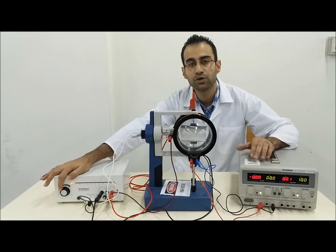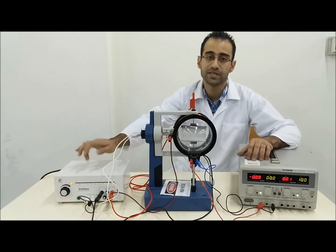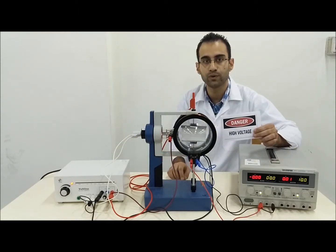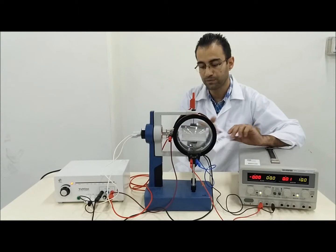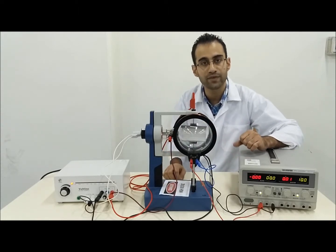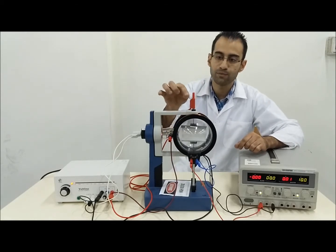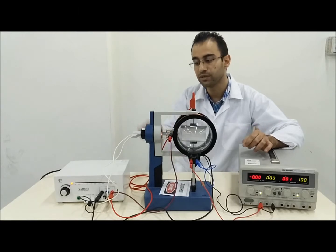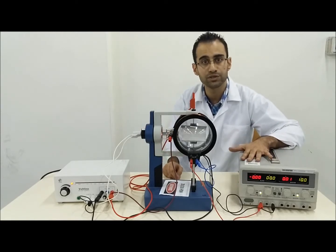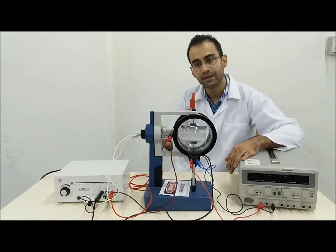Each small segment on the scale equals 250 volts. This experiment deals with high voltage — you will be reaching about 4,500 to sometimes 5,000 volts during certain steps. You should be extremely careful with the leads. Do not touch any of the wires, and always use the protected connection type. If the supplies are on, never change connections or touch any wires. Always switch off both supplies before making any connection changes, then switch them on again with voltage reading zero.